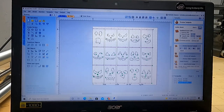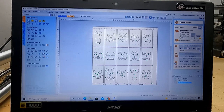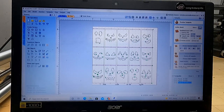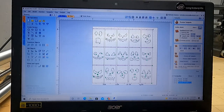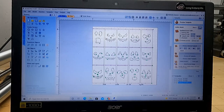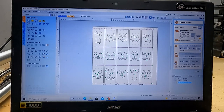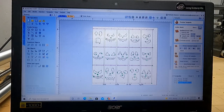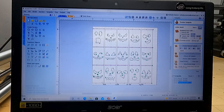The way this works is the boards are started at 0, 6, 12, 18, and 24 inches, the bottom left. I found that the pickets come anywhere from 5 inches, 5 1/4, all the way up to 6. The 6-inch ones I don't typically use on this, but don't pass them up either. They work really well for the tops because of the extra width. If you do end up only getting 6-inch ones, because this late in the year, you get what you get, you can still use them.